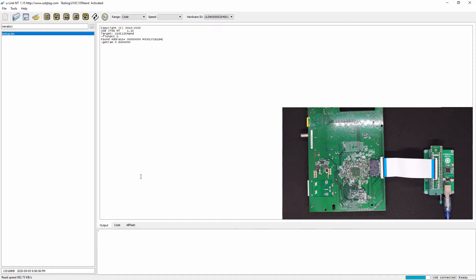This tool is not meant for programming massive NAND flash like 8 gigabytes or whatever. This one is only 1 gigabit, which is 128 megabytes, and reading at this speed is doable. Programming is about 500 kilobytes per second, so reading the entire flash on this one probably takes about two minutes or so — let's see. It's about one megabyte per second, so two to two and a half minutes. That's manageable on small-scale flashes for modems like this.